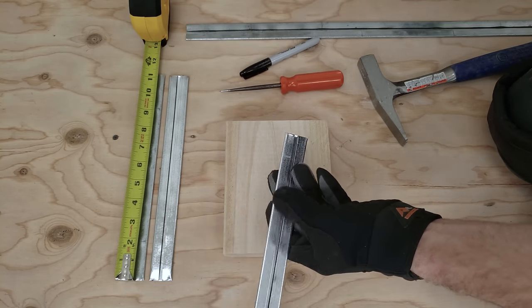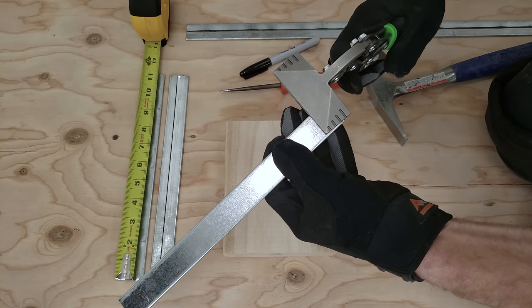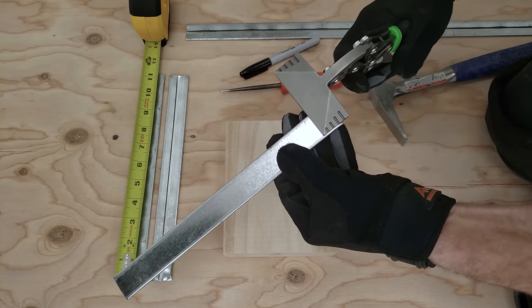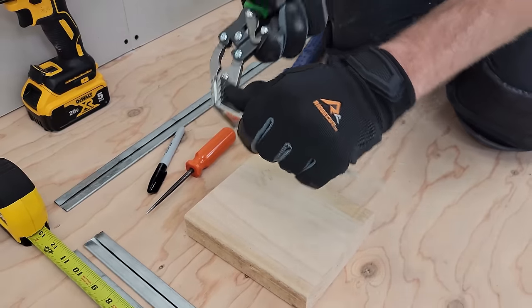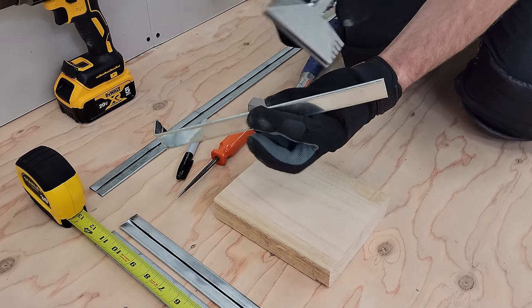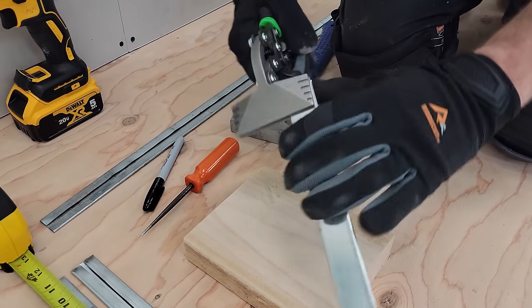What we do next is we take our handbrakes, and we have these little notches on the handbrakes. That's 1/4 inch, 1/2 inch, 3/4, 1 inch. So we have it set at 1 inch right now, and we're just gonna fold this over just like this. Now you could leave the bottom and fold that over after you hang the duct, or we could go ahead and do that as well.